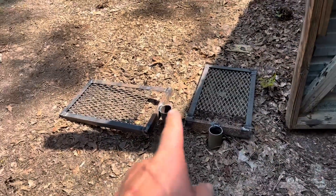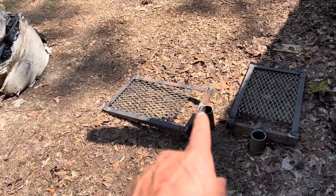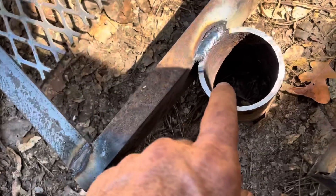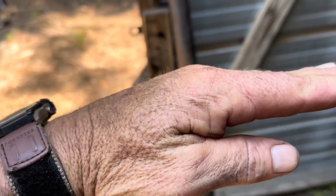She's gonna ride on that pipe right there. To level these things I put a speed square on a flat table when I built that frame and mounted that pipe. All I have to do is get inside this pipe right down here and put a spot weld just to build that up, and that'll pick it up — you see what I'm saying.